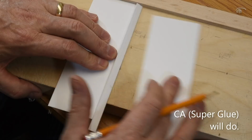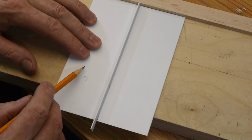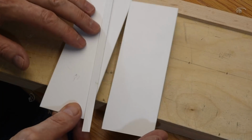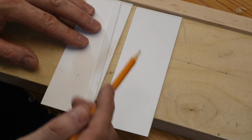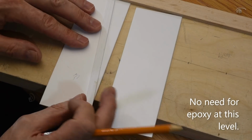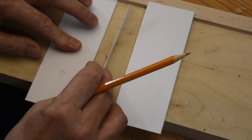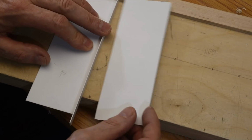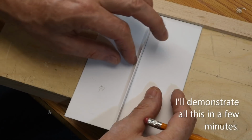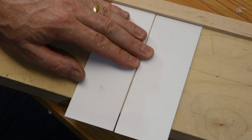And then I just put a spacer in like that, and once that's set, the CA will hold it right away. And the epoxy will take a little bit longer depending what you use, but the CA is a common glue used even by finish carpenters for clamping flat surfaces. Did you know that? Just the medium CA, you put a blob of CA there, a blob of CA there, and then a bead of epoxy, and you lay the panel down, bang, and it's clamped in place. And then when the epoxy sets, she's good to go. And once you've got one nice and square, then you can lay your spacer in, and then bring in your other panel like this. And then when that's set, you just pull that out. So there you've got your gap for your slab.